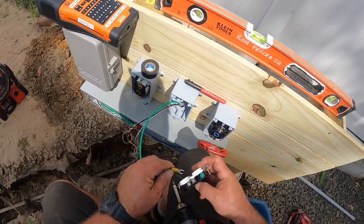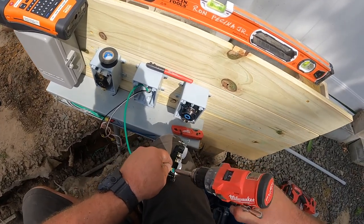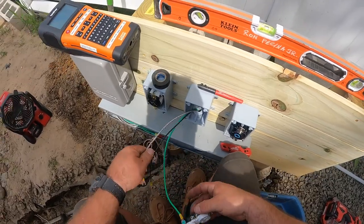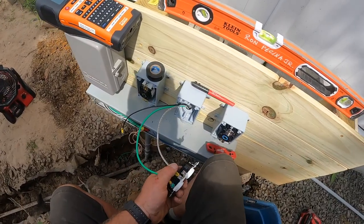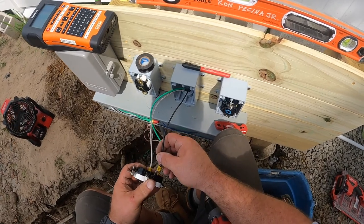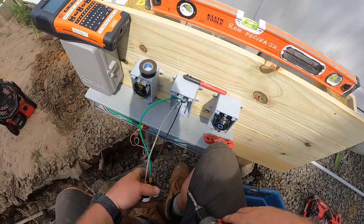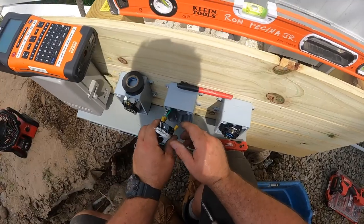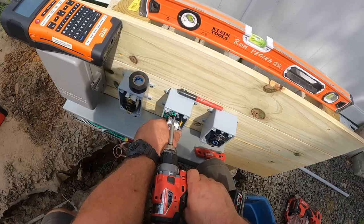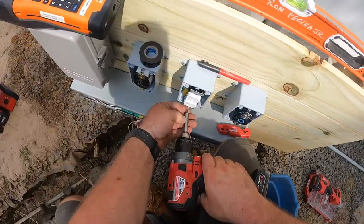This is the general purpose receptacle for service that's required. It's on a separate 20 amp circuit — I'm putting in a regular duplex receptacle because the circuit breaker will be a GFCI. In fact, all of these receptacles, all the wiring out here, and all the wiring in the conduit are GFCI protected via circuit breakers inside the main breaker panel. That middle receptacle is just for servicing — so if somebody comes to work on something, they have a place to plug in. It cannot be on the same circuit as the pool filter.